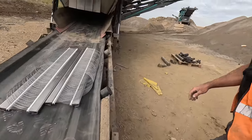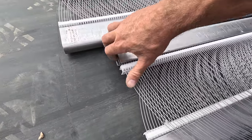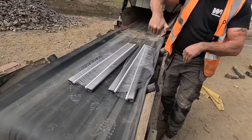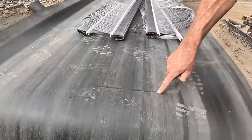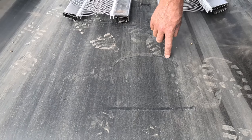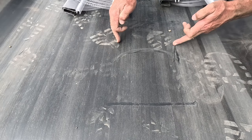Right, so these are a stainless steel piano mesh, 7mm, that means we've got a 7mm gap there. And now they're locking, you just open them up, you see how it's going to open up the mesh. It locks into a flat bar on one side, and the opposite side you've got a banana bar that's shaped like that, yeah? So always make sure it goes in that way, and then you have the two bolts there, pull it back and lock it in.